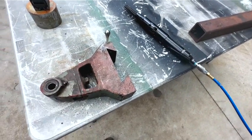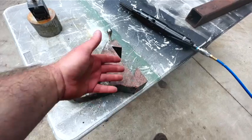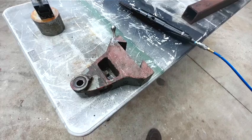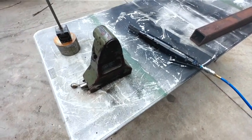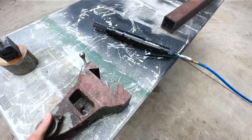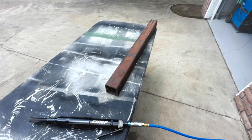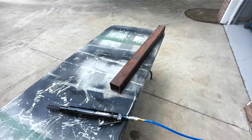Something like these corners would be very difficult to get paint out of with a wire brush. It makes almost chips — not a powder, but heavy chips that come off. So if it is lead paint, or if you're interested in keeping chemicals contained, it doesn't seem to produce much dust. For paint, it knocks it off pretty quick. For rust, unless it's thick flaky rust, I'd probably just use a grinding wheel or wire wheel — it's way quicker for something flat like that. But the needle scaler seems to do a good job.